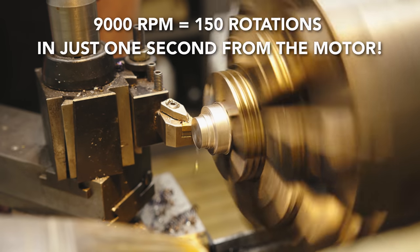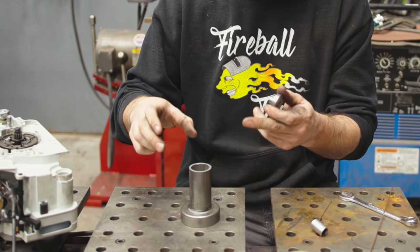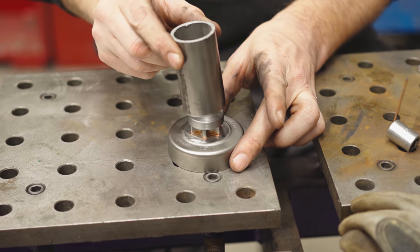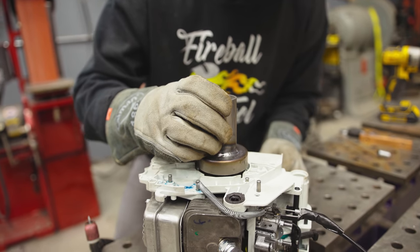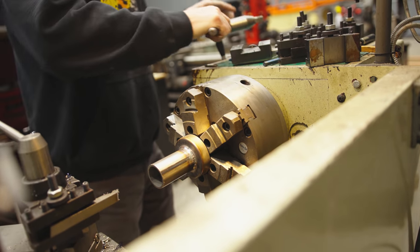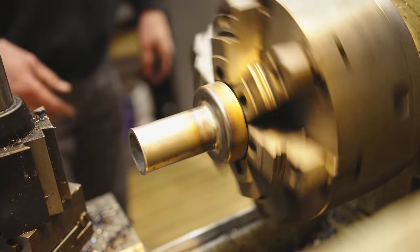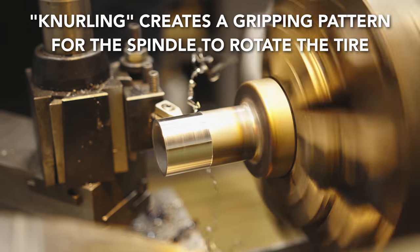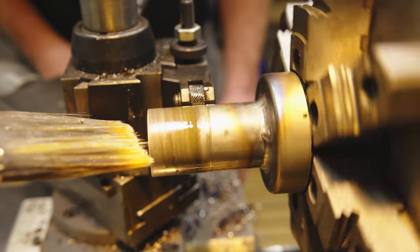This chainsaw turns at 9,000 RPM, and I'd like more torque than speed, so I'm going to try to keep the drive wheel as small as possible. I'd like to weld this piece of tubing to this clutch drum, but it's quite sloppy, so I turned down a little bushing to help get it aligned concentric with the body of the clutch drum. Test fit looks great — let's do it. Let's check with my eyeball how far off I welded it — it's pretty good, glad I took the extra time to put that bushing in there. I'm knurling the driveshaft for a little extra grip. Too much knurl and we're going to start tearing the tire up; too little and the driveshaft could slip. So just a little bit is all we need.